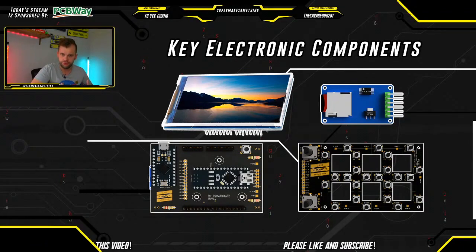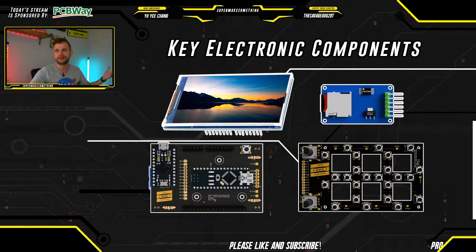And what the Atmega32U4 chip allows you to do is to pretend that the Arduino that you're connecting to is a USB keyboard. So for example, the Arduino can then be programmed at the push of a button to send a keystroke as if it were a USB keyboard to the PC. Then you can say, okay, now I press a button, for example, the A key or the B key, or crazy combinations like Shift Control X, if that's a macro that you want to assign. And again, the nice thing about this is that it's very programmable, so you can assign any number of keystrokes in series to the Arduino at the push of a button.